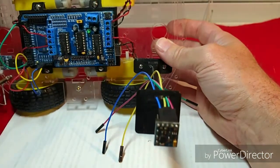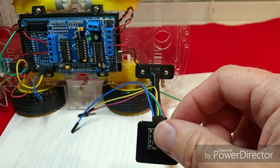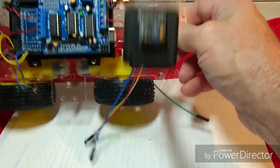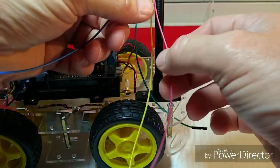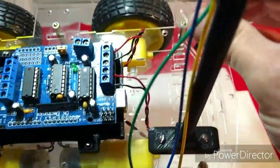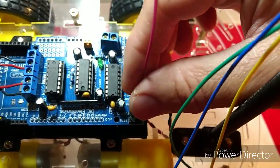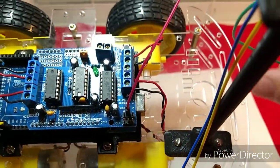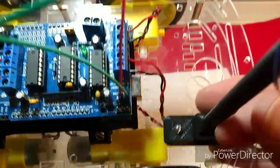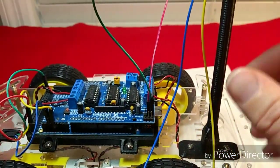We've got our magnetometer and compass running right through here. You can see there's a slot cut out for the wires so it fits nice and flat. We'll run a piece of tape over it to secure it. Then we just need to hook up our power leads — our red VCC and green ground — and they're going to go right to our motor control board. You can see the little plus and minus signs there — VCC to plus, ground to the negative sign. Now we've got power supplied to our compass, and we just need to hook up our data lines.